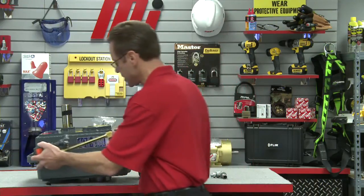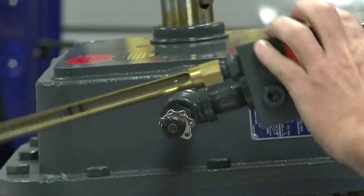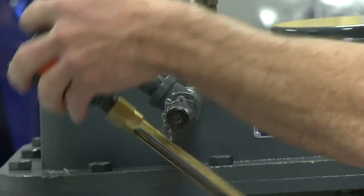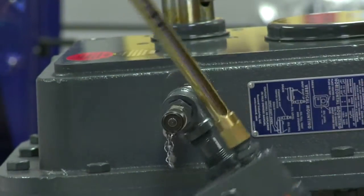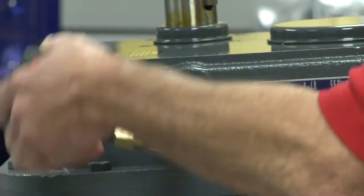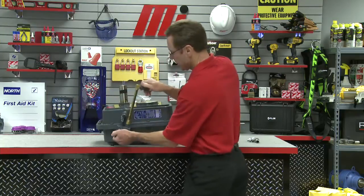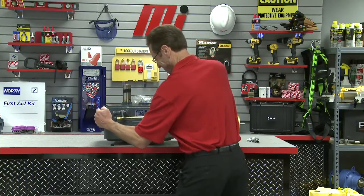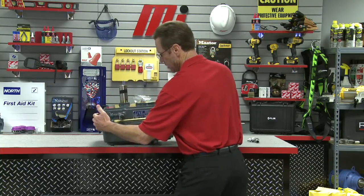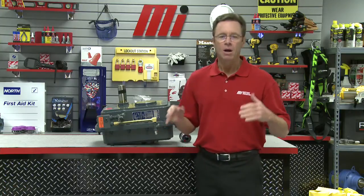Keep your hands on the outside — you don't want to touch the sight glass right there. Keep your hands on the gray, stay away from the brass, and do not hit the sight glass. Turn it two to three times after snugging so that it's oil tight. Be careful not to impact the sight glass, the anti-foam block, or fittings with any tools — keep the tools away from it.